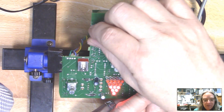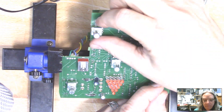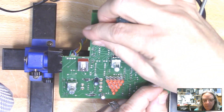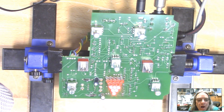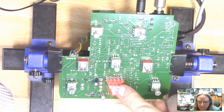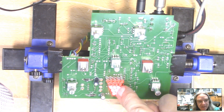We've got attack time over here — right now it's pretty slow, like we want it to be. If I go faster, we'll lose our transients. I hope this was helpful — that's our troubleshooting process and details on how to test and where to test. The fact that this gain reduction meter is working tells me a lot about where signal is getting in the circuit, so there's a lot of testing I wouldn't have to do just by seeing this and knowing how the circuit works.